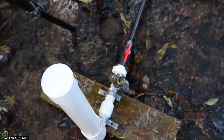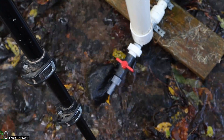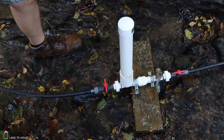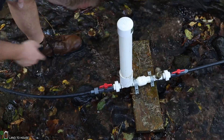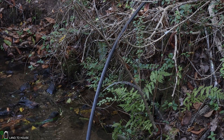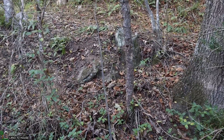I need to get that air out somehow, but for the time being let me go ahead and connect the delivery pipe going uphill and see how far up this hill we can make it. As soon as I open the delivery pipe valve, the cycling is going to stop - water has gone up into the pipe and bypassed the system. Found our first leak over here. Well, there's your problem. I might just cut that piece off and pull it down a bit more. I just found another leak right over here, so that's going to prevent the pump from working. We were trying to use old pipe found in the woods, but this may just have holes all in it and may not be usable.